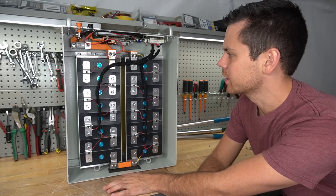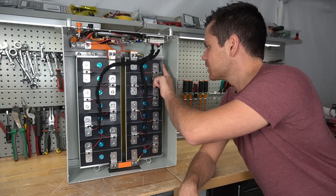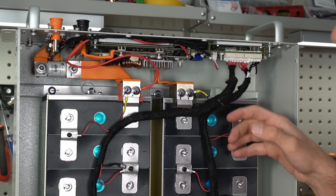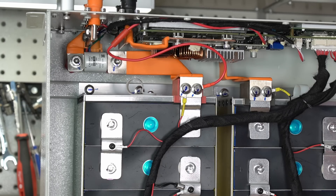There's a nice fuse in here — this is a very different configuration than other server rack batteries. It amazes me that these cells are 100 amp-hours because look how small they are. Notice the bus bars they're using — these are the same types used in their other batteries and they're very high quality. The fuse they're using is rated for EVs, which I prefer over any circuit breaker on the market. The interrupt rating is 20,000 amps, making it comparable to a T-class fuse. We only see these types of fuses in very expensive packs like a Fortress Power battery, so that's nice to see. I'm pretty sure this will pass any UL conformance standard.